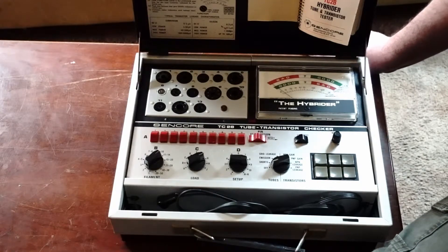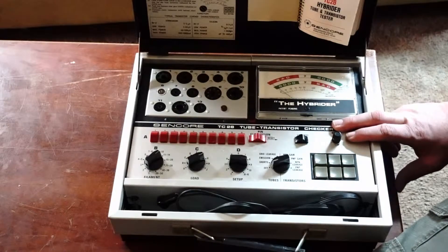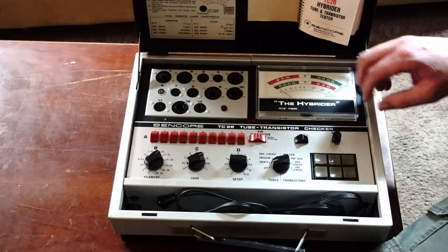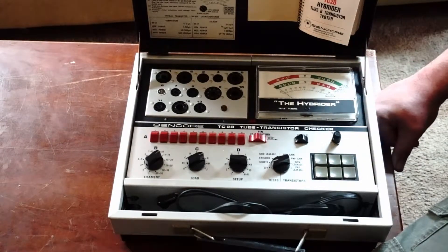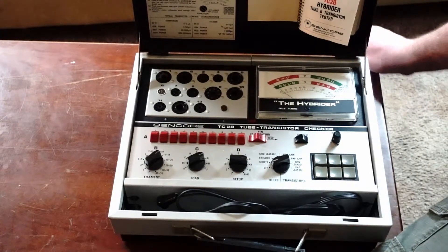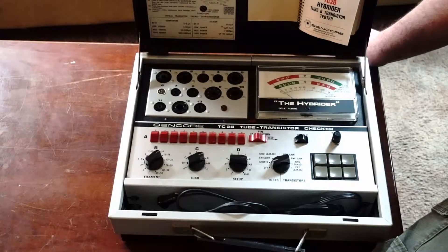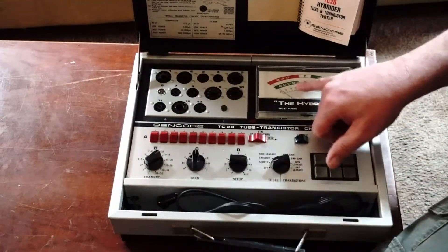The problem was, I started going through a batch of a couple of hundred tubes that I purchased from a state junk tube retailer online to see if any of them were salvageable or saleable. About two or three tubes in, the checker began making some strange noises — buzzing, almost like it has an audio tone it was trying to emit, but there is no discernible mode where that should be the case when checking tubes. When that happened, the meter would also jump from good back to bad back to good. It almost startled me enough to unplug it immediately. I checked and it wasn't drawing any abnormal amount of current, so for a time I finished off the batch. But then I noticed that any time I tested a tube with a heavier load indication on it, it would begin bouncing and acting strangely.